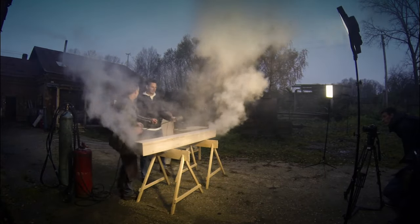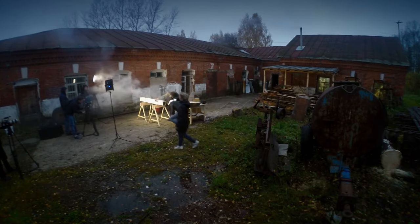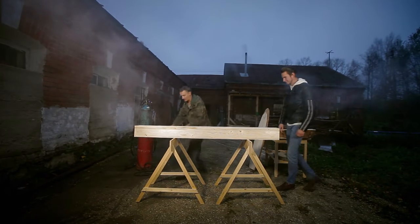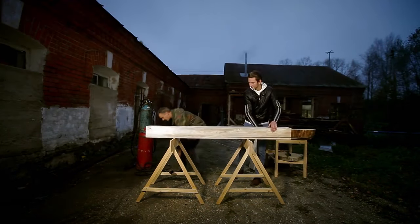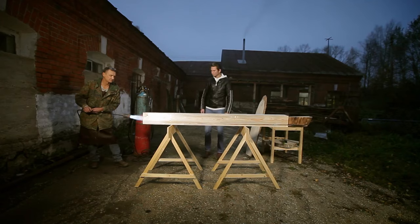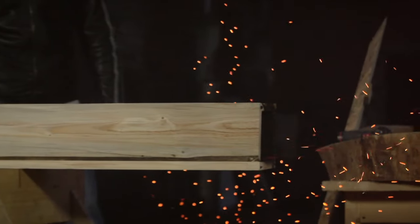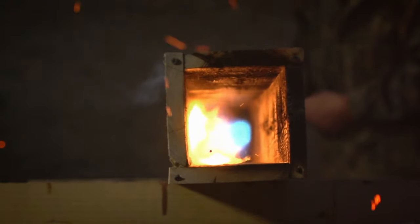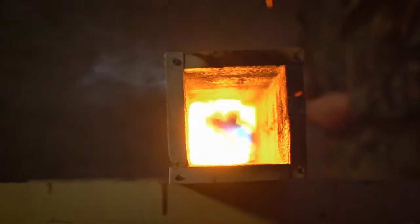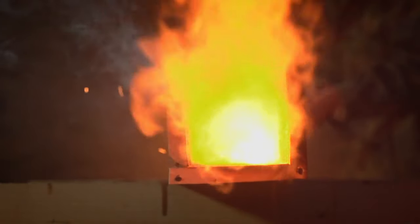Do you want to say that after that, the wood will become stronger? Only the resinous layers will become stronger. We need to turn it to burn it from that side as well. In the course of thermal decomposition, under high temperature stress, the so-called fiber channels in the outer plies get narrower, filled with tar and combustion products. As a result, the board really becomes stronger. Besides, the burned layer protects it from harmful insects and fungi.